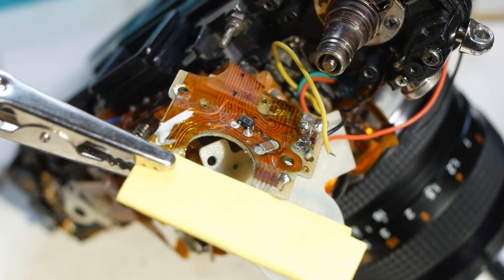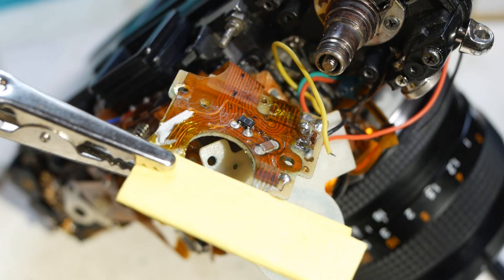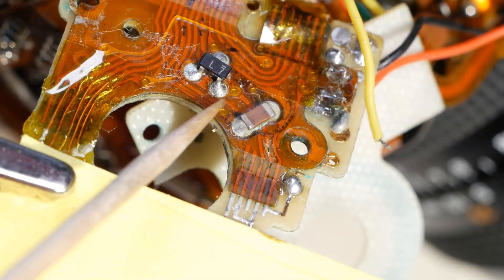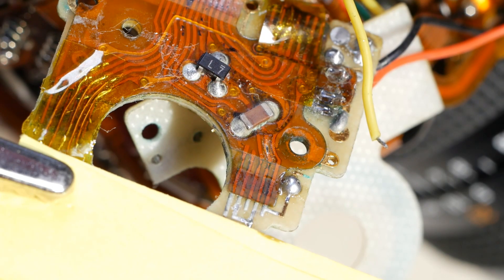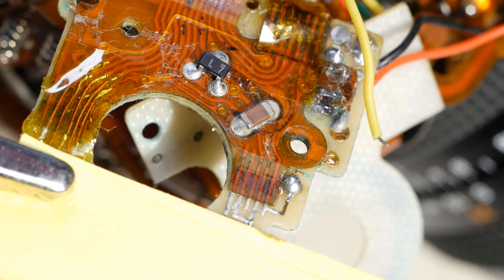Anyway, after I'd packed everything away from filming the end of the video, I got thinking and I still hadn't traced all of the tracks from the power-on transistor. Some tracks from this board head off towards the main logic chip, disappearing underneath it and where they come out, no one knows. But the bottom right leg of this transistor heads into a via here and down to this track which is soldered to the rigid board. And checking the track thoroughly, there's no continuity — the track, like the ones on the other side, is broken where it's corroded. So I'll get that repaired and then give the camera another try.